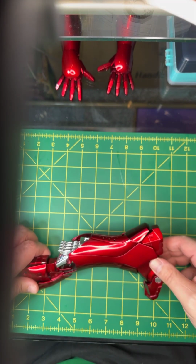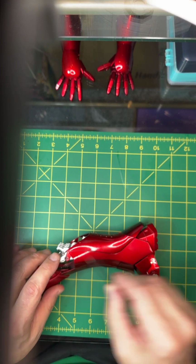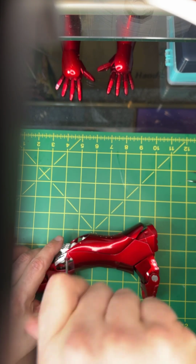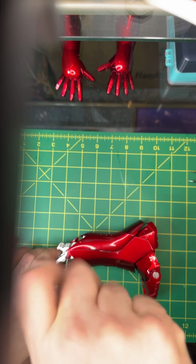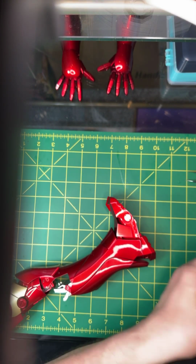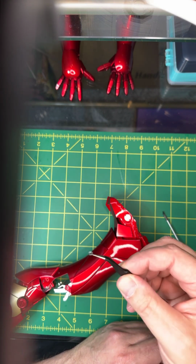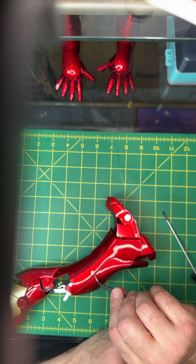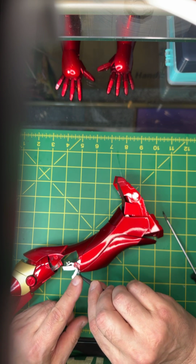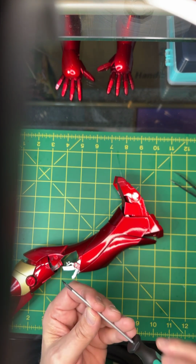Then they give you these friction discs. I got them right here. They go inside the slot. And then you install your screw. Don't tighten it all the way until you get the other side started. Let's get the screw ready. Get the other friction disc. Do you see that? It goes right there. And then screw in the lower leg.